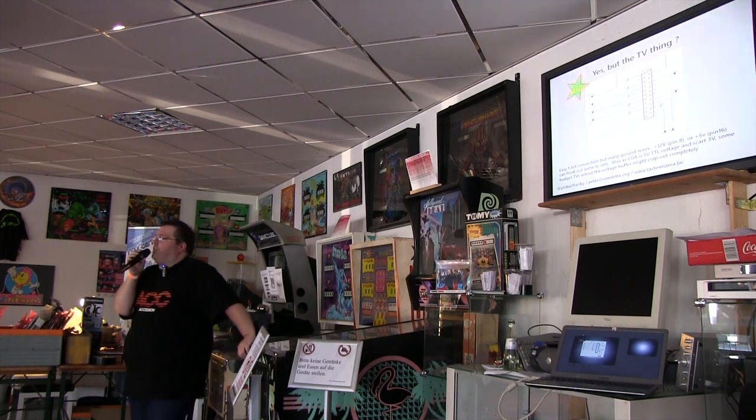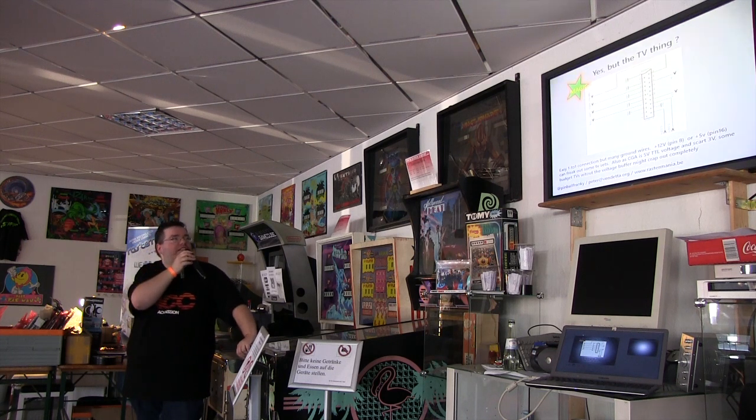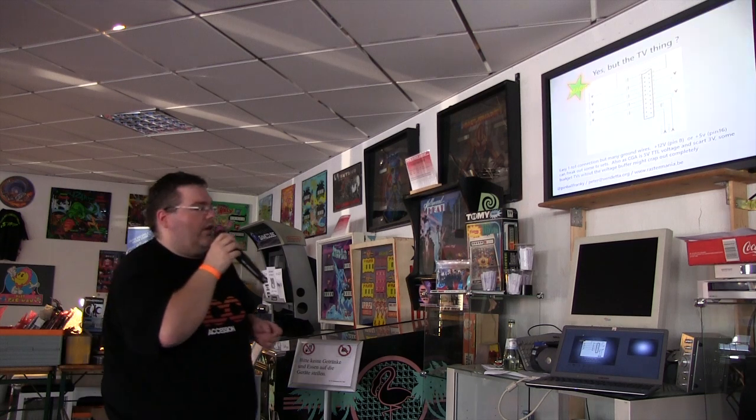And for the auto select, which is, in the 90s when you switched on your DVD player, your TV would automatically go to the DVD signal. For this, it was a special pin with a voltage, which you also need to fake a bit, and it depends on each TV model. But this is only when you're using an old TV to replace an arcade monitor.